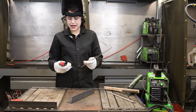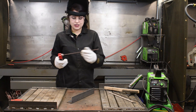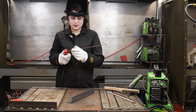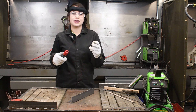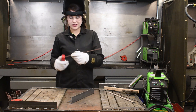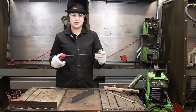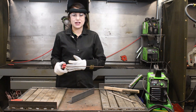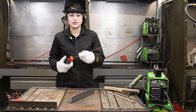Also, when you are placing your stick inside of your electrode holder, there are a couple of different ways that you can do this. There are grooves in here, so you can put it straight across so you have a 90 degree angle coming out of your electrode holder and then go in and weld. There is an X so that it is about 45 degrees, and also if you need to get into a tight area, you can just feed it right out of the front and have a smaller surface to get into wherever you are trying to weld at. Remember that this is hot, so when I finished that last weld, I removed my electrode before I put the stinger down. If you put this down and it contacts any metal that is grounded, it will arc. So remember to keep that in mind. If you throw it down and it arcs on the table, to avoid that, just remove your electrode from your electrode holder.